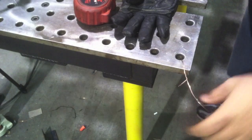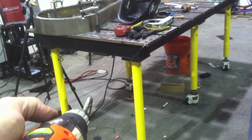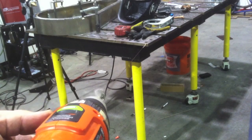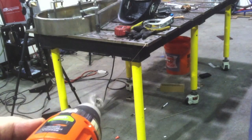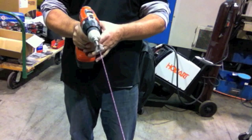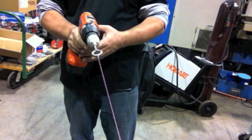Here's what I do when that happens — this might be obvious to a lot of people, might not be to some. A lot of times you've got leftover little runs of MIG wire that you coil up from stripping out a gun or whatever. If you hang on to them they can get you by in a pinch. I'm just twisting some .035 wire — or maybe .030, I don't really recall — up real good and tight with a drill motor, using an eye bolt chucked in the drill motor.